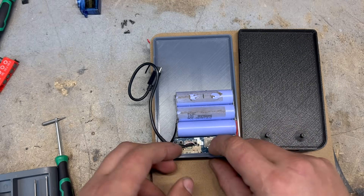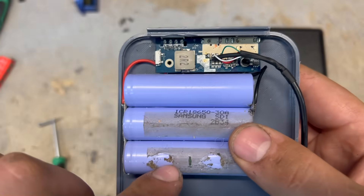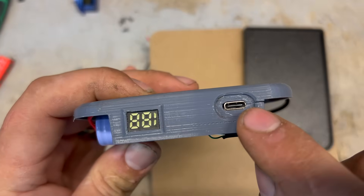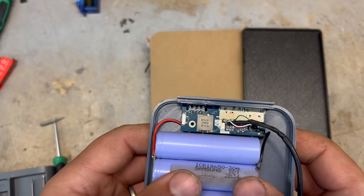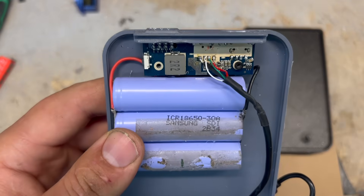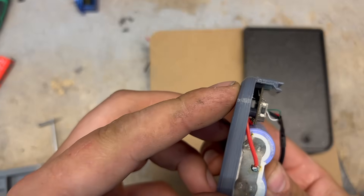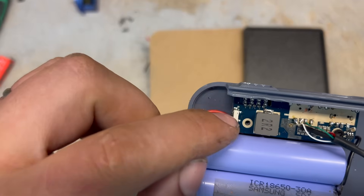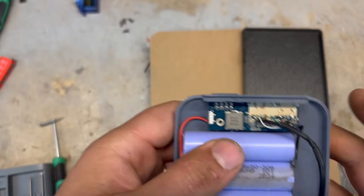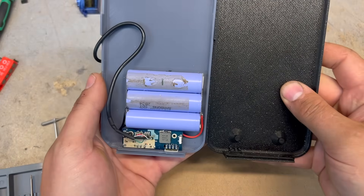That's pretty much all assembled and it looks really good. Now let's work on the back plate. It's pretty simple — basically just a circuit board out of a power bank I bought on clearance. It had a single 10,000 milliamp-hour cell, which I've used in another project, but the board is really cool because it has USB-C in and about a three-and-a-half amp output. The USB-C cable is soldered directly to the output and powers the Raspberry Pi. There's a power button here, but I haven't come up with an elegant solution — most elegant would be to solder some wires on and have a recessed button on the back.